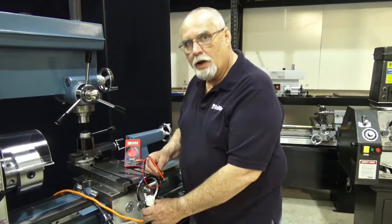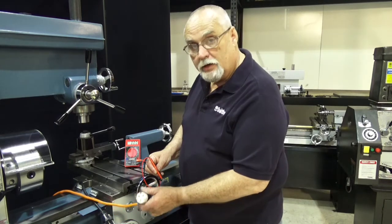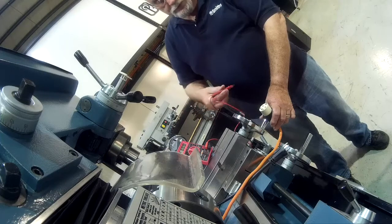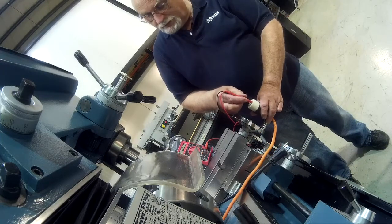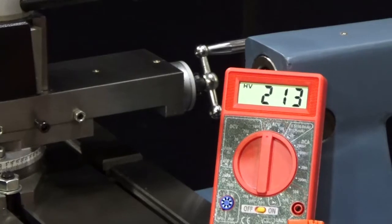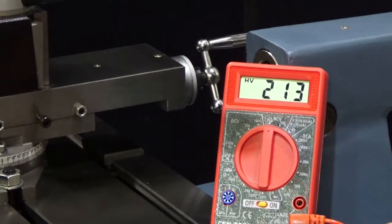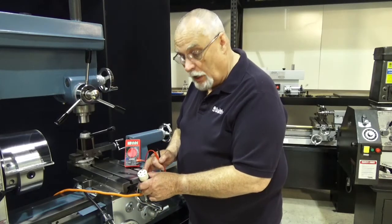Now I'd like to show you how to properly check the voltage at a 220-volt outlet. I've got a 220-volt extension cord here. I've got my meter set on AC voltage. Let's put a probe into each one of the slots. And there we go — you can see our shop voltage here. It fluctuates between maybe 213 to 215, which is fine. It is possible to hook your wires up wrong in your electrical box.